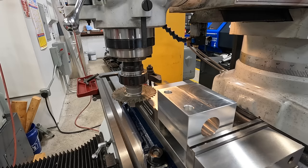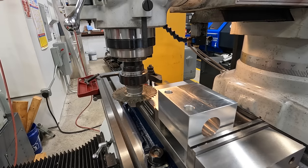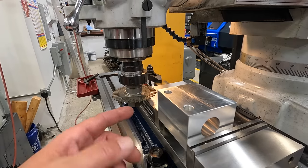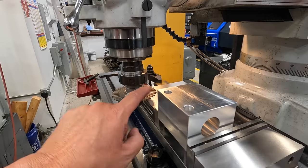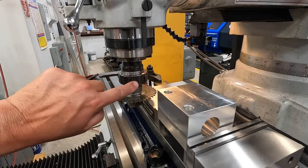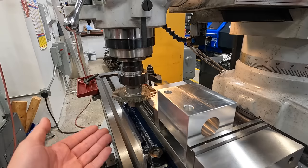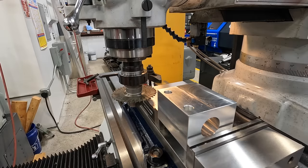And all right, I already see a problem. I didn't figure that. All right, I'm gonna have to redo what we just did. What's gonna happen if I run across here right now? The workpiece is gonna run into this nut right here. So I actually need to bring this down out of the collet a little bit. I didn't think about that till I just saw, but that's what you do when you get everything set. You try to make sure you're clear.